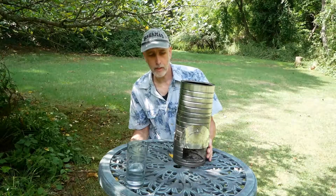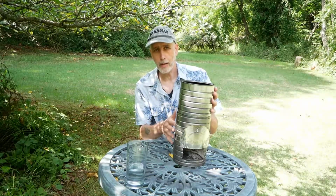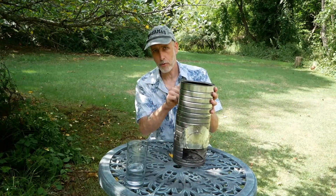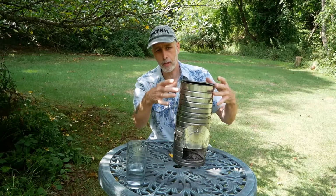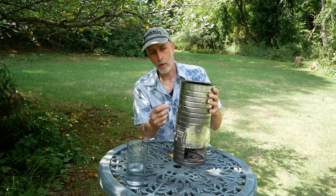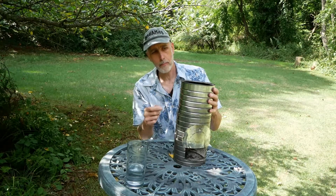like I cut this with, believe it or not, a razor knife. Now if you guys do that, be very careful, because you have to push very hard, and that blade could break. You're probably better off drilling a hole. You could just drill a series of holes around here, because you need those flames to be able to come out. So you want the openings pretty big, like 1 inch. So you could drill some holes and then use a jigsaw to cut out some.